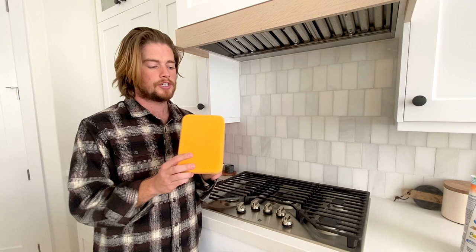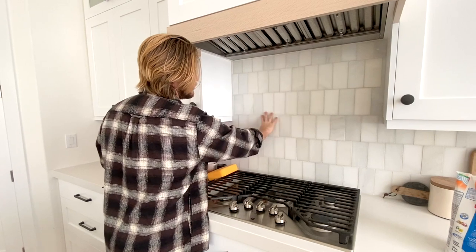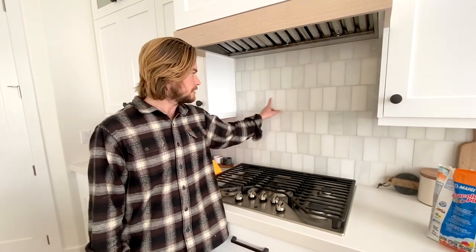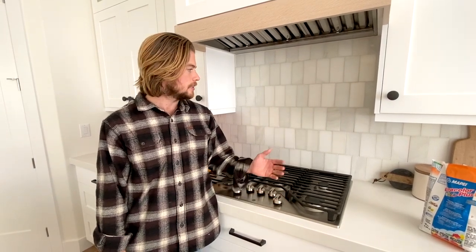All you need to do after that is clean up. Get a damp sponge and wipe off any of the residue — it will gather quite a bit on the surface of the tile so you'll probably need to do two or three passes. The last thing we'd highly recommend, although it's not required, is sealing your entire backsplash — the grout and the tile itself. This is a soft tile and it could absorb stains and oil stains. Buy tile and grout impregnator: just dab it down, get it all wet with the sealer, let it dry, and you're good to go.